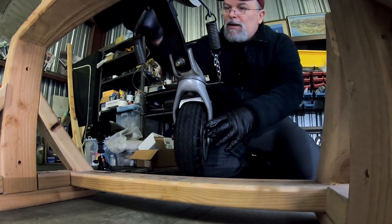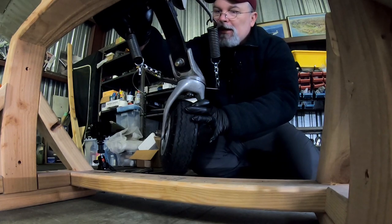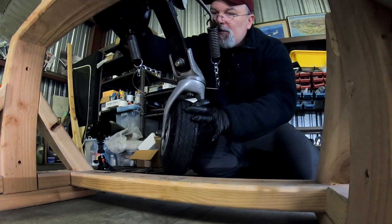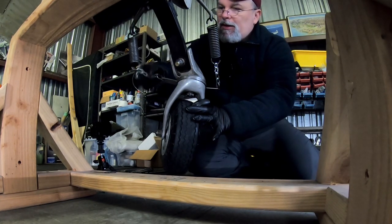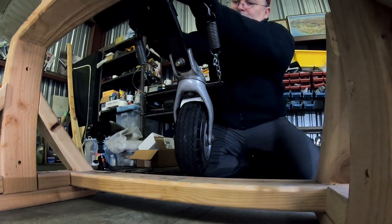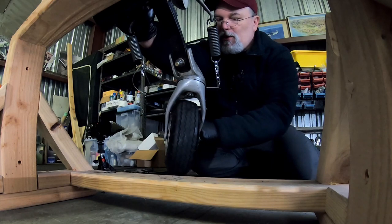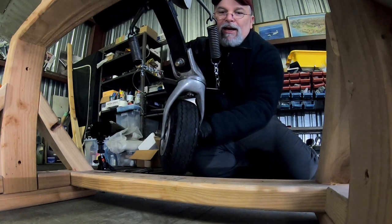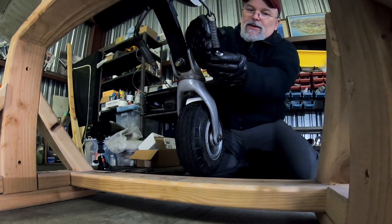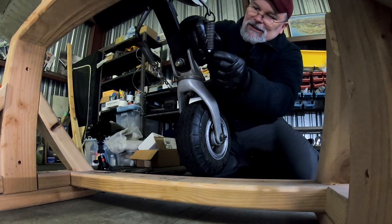Okay. So if we're full right rudder and full stop, see the tension on the left spring is making that chain here too slack. So what's happening is we're trying to go right rudder and push the tailwheel to the right, but now we're fighting this other spring because this is too tight. So what we want is to where this is just loose enough. Oh, I got both of them too tight.